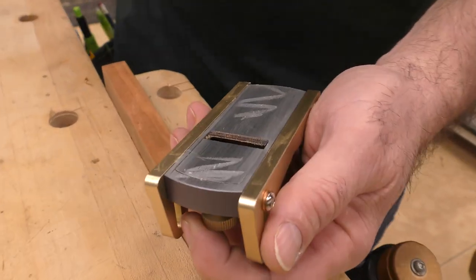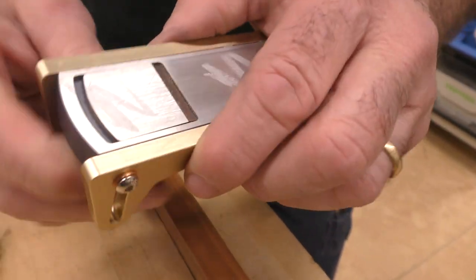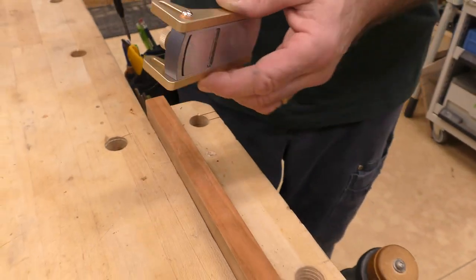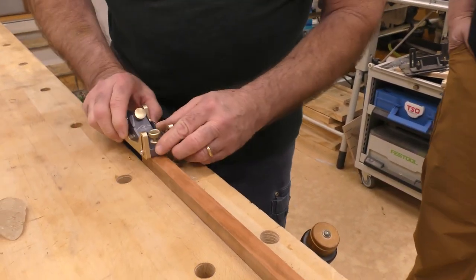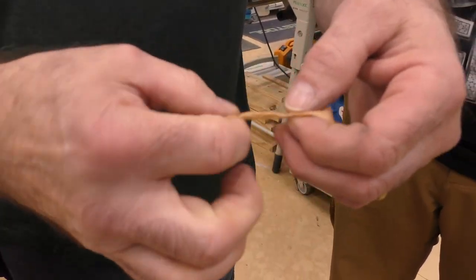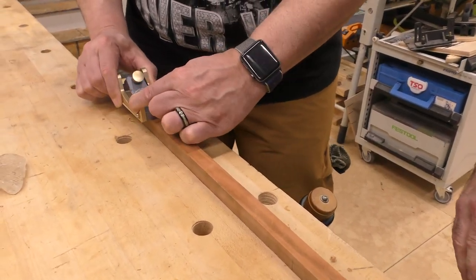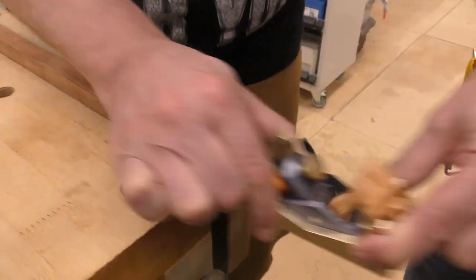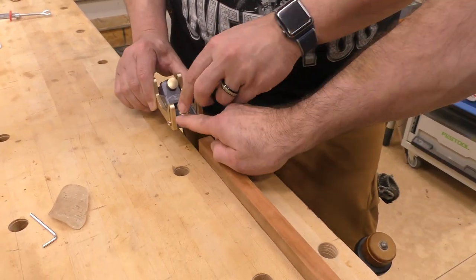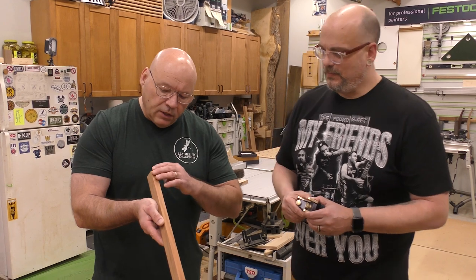You see the distance from here to here? I want to break that shaving to help prevent tear out, so I'm going to bring the throat in — I need the clearance for the chip to come through because that breaks it right here. Look at that shaving! Look how perfect that is. I'm going to have you take a swipe — just like a big bench plane, put pressure here on the front, and nice and steady. That's a really nice finish on there. That's a sign of a really sharp blade.